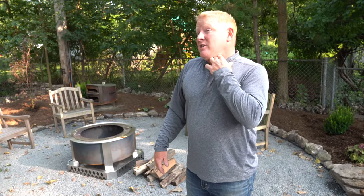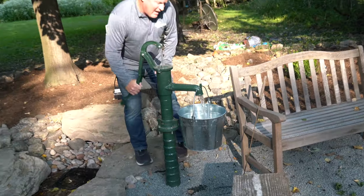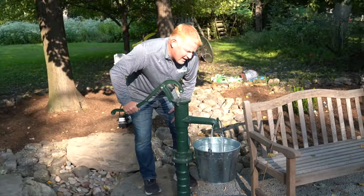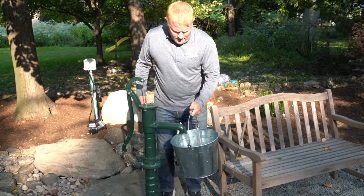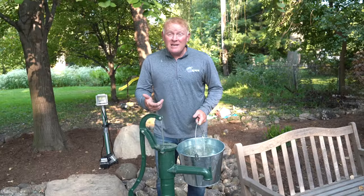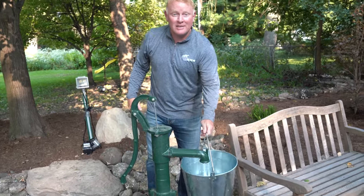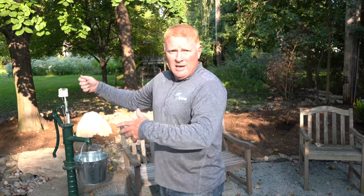The other thing we did that was a little unique and a little bit of a surprise — they said, 'Brian, could you implement this into the water feature?' And that's this well pump over here. There are a lot of small kids that come out into this area, so they wanted something more interactive for the children. We set up this well pump and it works perfectly — this is just drawing water right out of the bottom of the reservoir. They can use this to water different plants, give the Japanese Maple a drink. And the best part: if it spills or a whole bucket gets dropped, it all goes right back down into that 3,000-gallon tank. We're actually solving a problem out here. Being able to reuse that water reminds us that this whole project was put back here for a rainwater harvesting purpose — now all that water goes into this tank where we can keep our water feature totally self-sustaining, meaning we never have to add water to it.